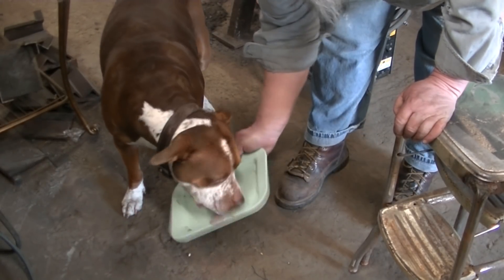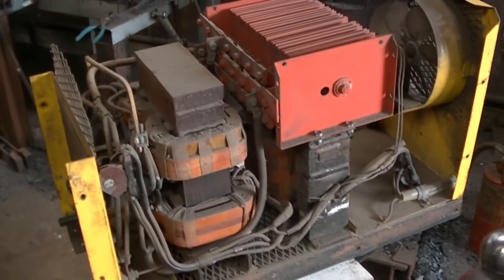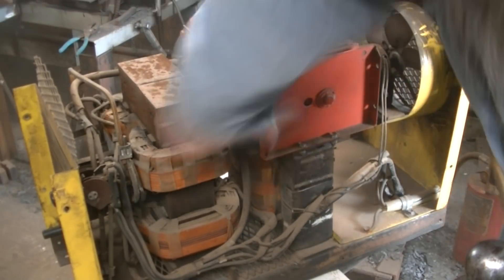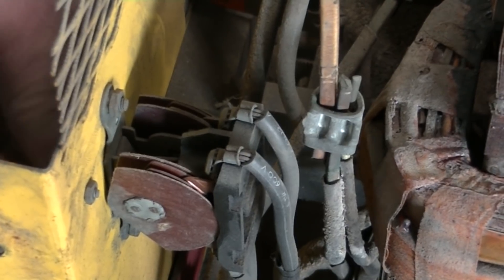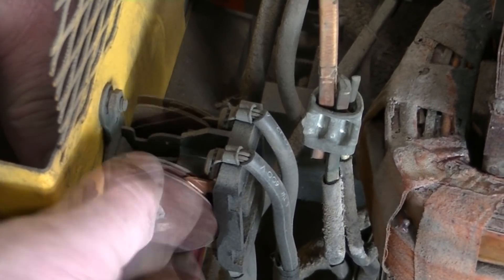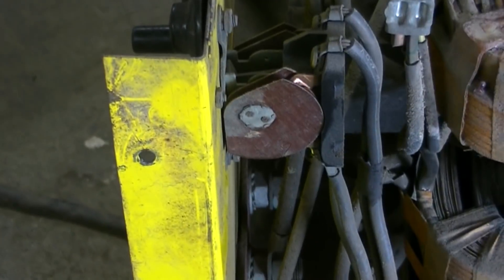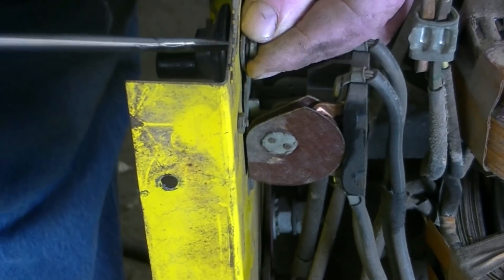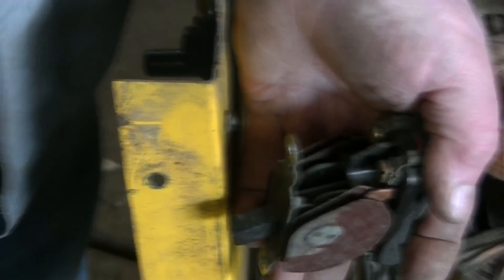Back to this guy. It has a giant coil in the back with a giant rectifier sitting on it, two giant coils in the front with a slide that goes between the coils to adjust the amperage up and down. It's a beast - same ways it weighs over 200 pounds. The switch looks like it's just gummed up with dirt and crud over the years.